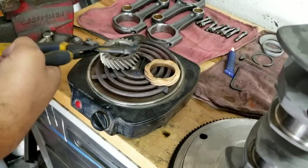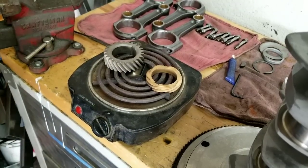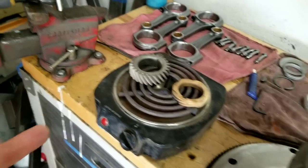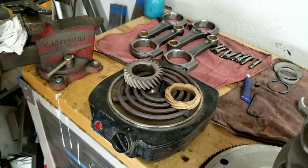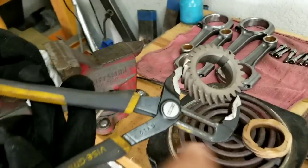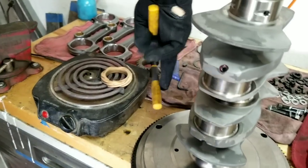With the woodruff key in place, we use a hot plate — some guys use a torch, you can do whichever way you want. We use a hot plate because it makes a nice consistent heat and then both gears are sitting there hot, so you can just slam them both on. We use pliers to put them on — those things get pretty freaking hot, so pliers is a good way to grab them. This end goes down.